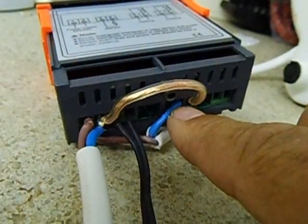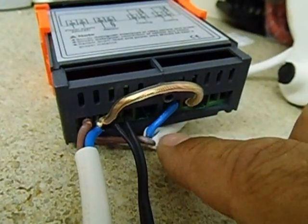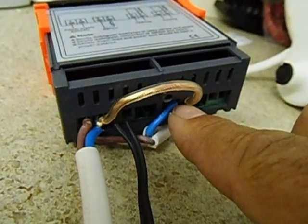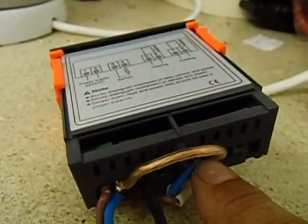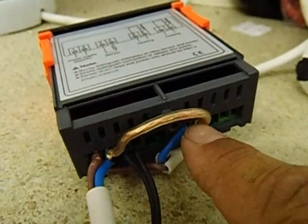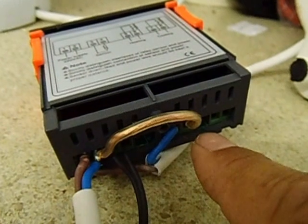And then number five — that's the wire that runs back to the fan, which is also negative. So when you bridge these two wires, the two negatives, the fan will work. And that's how you connect it. Make sure you connect it up on number five and number six of the heating relay — not cooling. It's got to be on a heating relay.